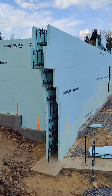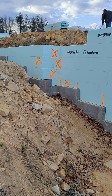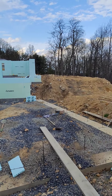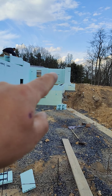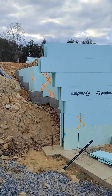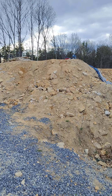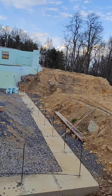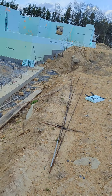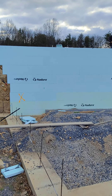This wall right here was supposed to be framed, and this lower garage wall is supposed to be framed — it's just a knee wall to get out of the frost line and get us back up. But when we eliminated the top rack, that wall over there is at final grade. We had a lot of leftover material, so instead of buying lumber — I would need three-quarter plywood to form the concrete, which in some places is 95-plus dollars a sheet — we decided to go ahead and cut that in and just do the whole thing in ICF.